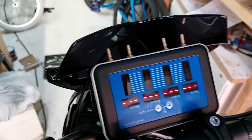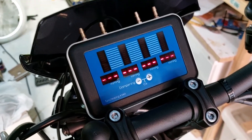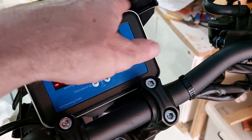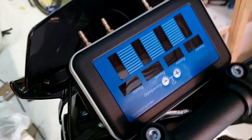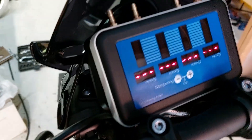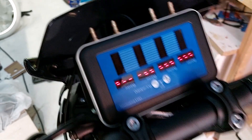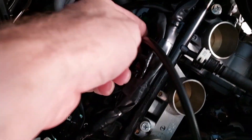It calibrates to atmosphere when you turn it on. Turns out you can't have the hoses connected when you turn it on or it won't calibrate properly — which is just an absolute nightmare. So power it on with nothing connected, and it should be calibrating. The hoses need to be disconnected.